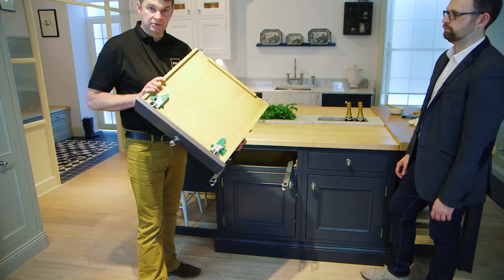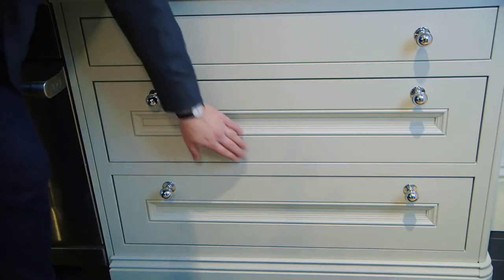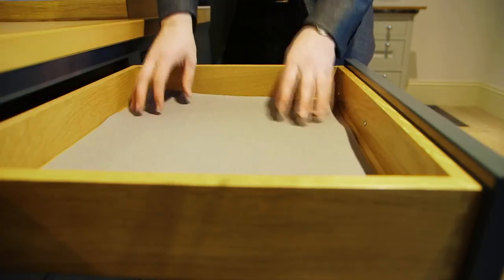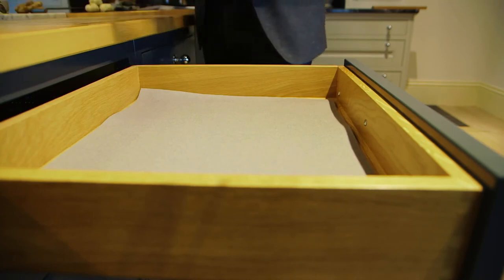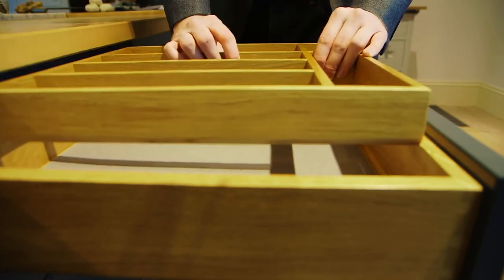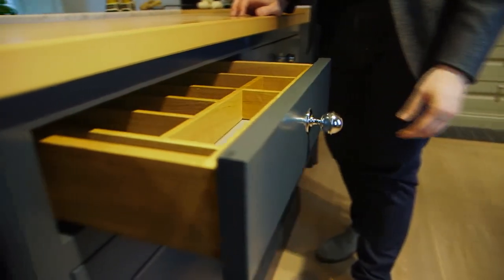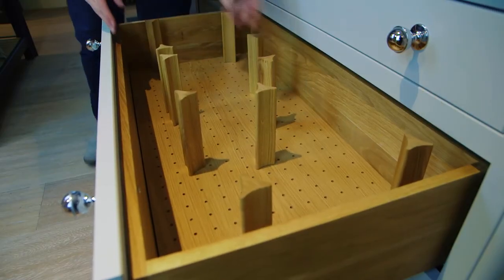The runner system has three-dimensional adjustment. On all 1909 drawer configurations, there's something to note: in between each drawer frontal is a dividing rail, which will have an effect on your drilling positions for your drawer runners. All dimensions are detailed in the technical manual. The dovetail drawer boxes are available in 90mm high and 186mm high back and sides. A wide range of accessories are available, ranging from cutlery inserts, felt bases, and plate holders.